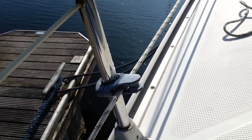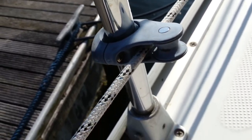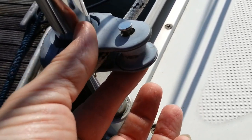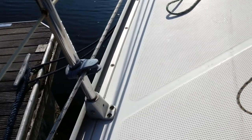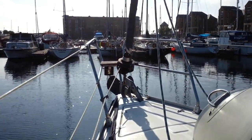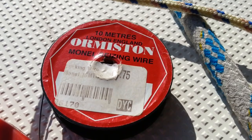To show you what caused this sudden concern, look at this. This is our furling line which pulls the foresail in and out, and it runs through this roller. This pin is the pivot — and look at that. That pin is loose. It has nothing underneath holding it in place. We were lucky — this popped out, landed on the deck, and rolled into the toe rail. It could have gone over the side. This line came loose. Fortunately we have more of these which run up to the furling drum, but we decided to go and check them all and check the clips. We now have some seizing wire which I will be putting on here to hold it in place.